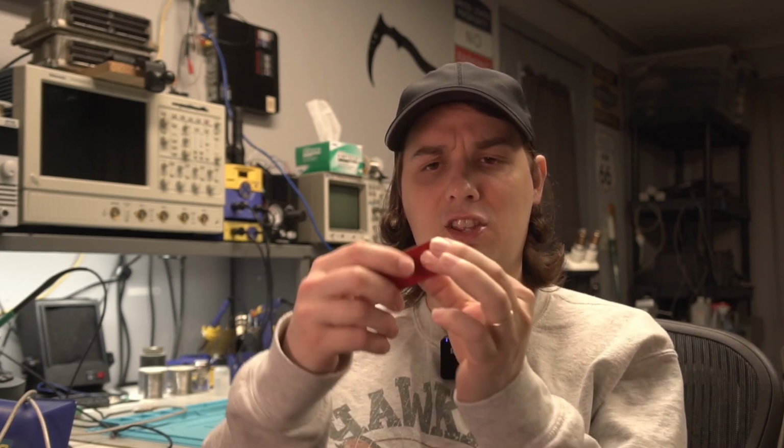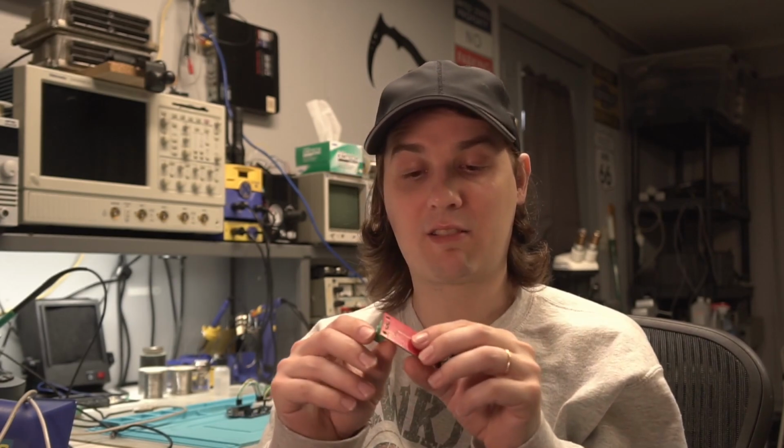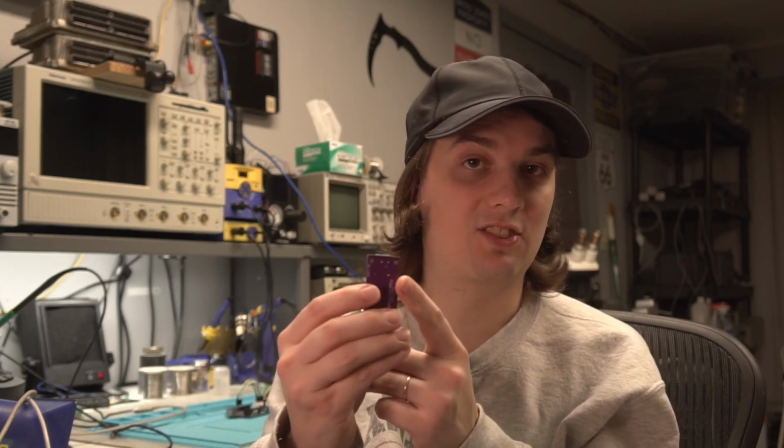The other thing is, I added this one connector here that can replace the screw terminal, so it's just the 2.54 millimeter. That way you can just do pin headers and put it on. I did kind of mess up in this design, and I forgot to keep my 2.54 millimeter spacing from this side as well, so they don't line up anymore with this. Obviously that connector didn't even exist on Rev A, but yeah, Rev C, I'll fix that as well. So Rev B is just missing silk screen, and I'm going to change one connector, so that way you know what the differences will be in Rev C if you buy them.